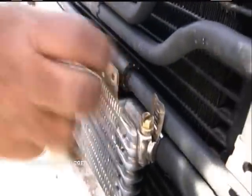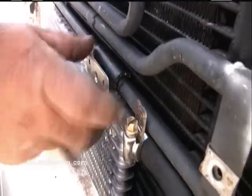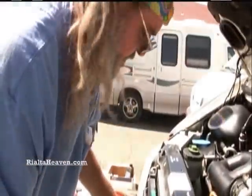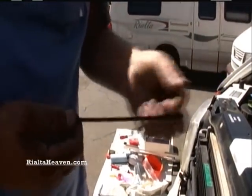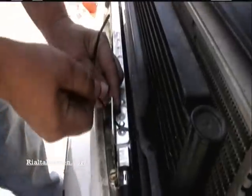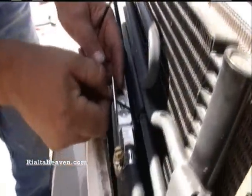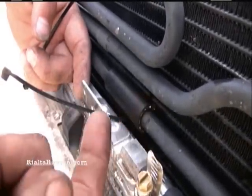We're going to move our hose just a tad to get it all lined up — it all fits together. Now, a couple of little tie wraps. I know that on 3M, the black ones have UV protection built in and the white ones don't, so I tend to use the black ones. How would you know that? Read it online — and I happened to work there for a couple of years.